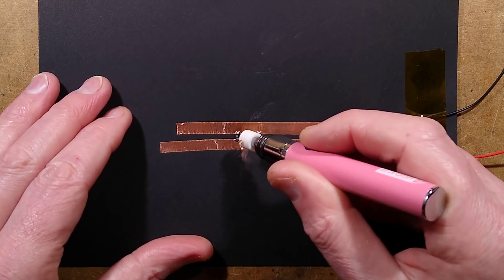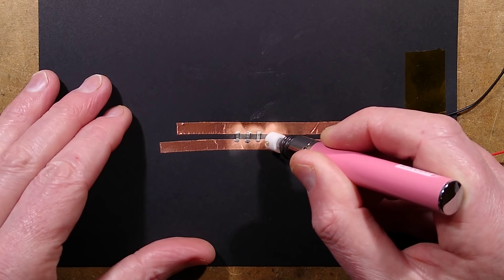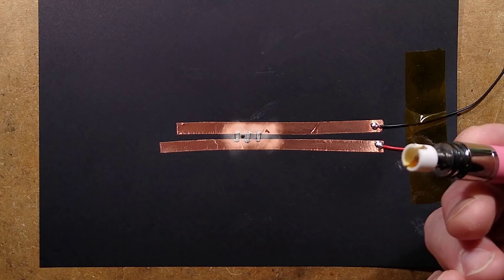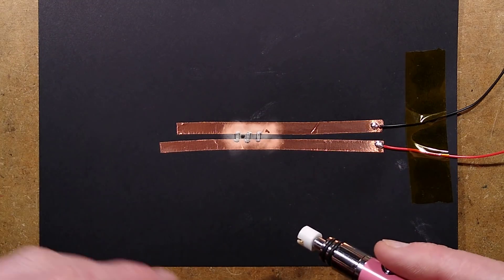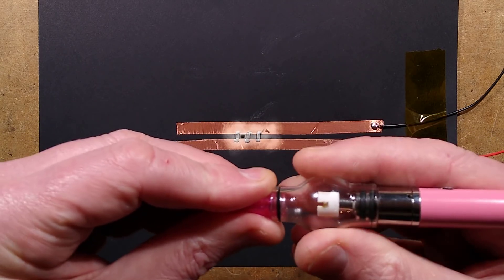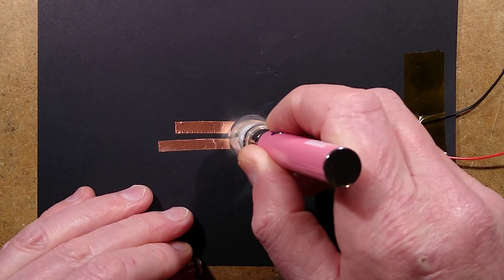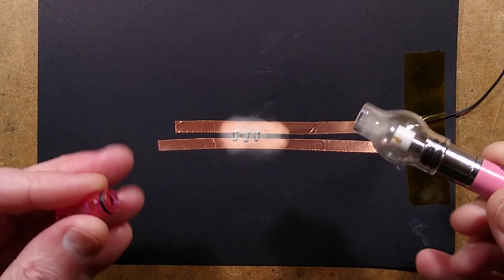I'm going to hold the button and after a while you'll see that it starts putting out a cloud of vapour. The vapour is vaporized flux which is forming a nice white coating on all the components — basically deposited vapour that has recondensed into lots of crystals of resin on the surface. Most videos show it being used with an enclosure in place, but I prefer it on its own, though in windy conditions you might want a cover so the cloud isn't disturbed by ambient ventilation.